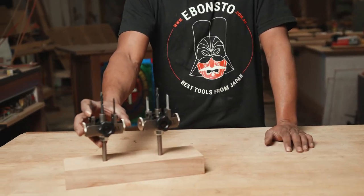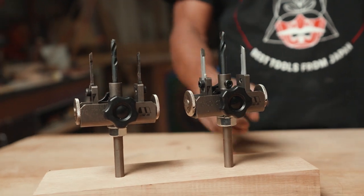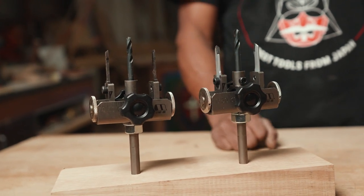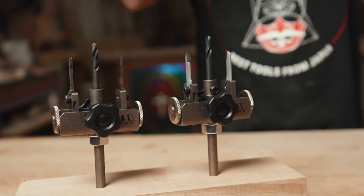With the Star Rim adjustable circle cutter, you can make sure by doing a few test cuts that the hole size is perfect for your downlight. There are two types of hole cutter: one has high speed steel blades and one has TCT — that's tungsten carbide tipped blades. The TCT version is very good for cutting fibrous cement, which is the sheeting that goes under the eaves of a house. Quite often you have to fit lights, plumbing pipes, and electrical pipes through this sheeting. The TCT version cuts it very cleanly. Let's get on and see how they go on different materials.